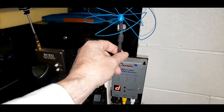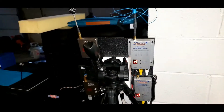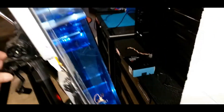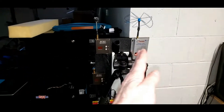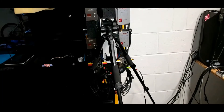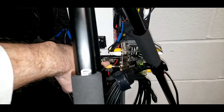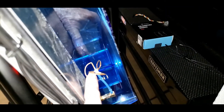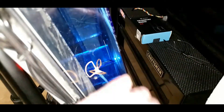I didn't put my notch filter on for the 915 Crossfire, but I will do that. And of course on the back side of this is the big pepperbox 1.2, and then an omni on top, and then the left side is 5.8 video. Now I can relay this 1.2 video via this 5.8 video transmitter here out this little antenna — which probably isn't a very good antenna now that I look at it — to goggles. So I can take in the 1.2 and relay it out 5.8.